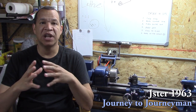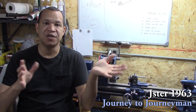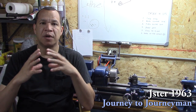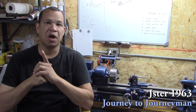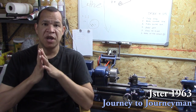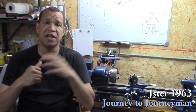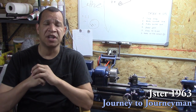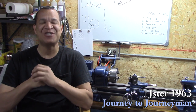Well guys, a quick recap on lessons learned. Number one: make sure that you oil your back gear and that your lathe is properly lubricated. Also, be careful out there and observe your safety rules. But the biggest thing is I didn't realize what was going on in this episode until a couple of projects down the road, where I figured out the spindle was loosening up. If you're hearing vibration coming from the machine and not your work, it's probably time to investigate something coming loose. Thank you very much for watching and see you on the next Journey to Journeyman.